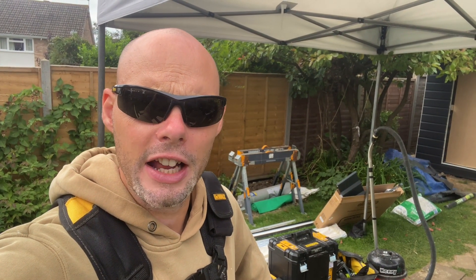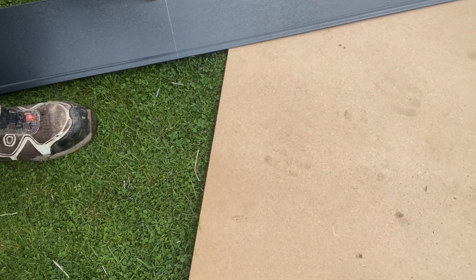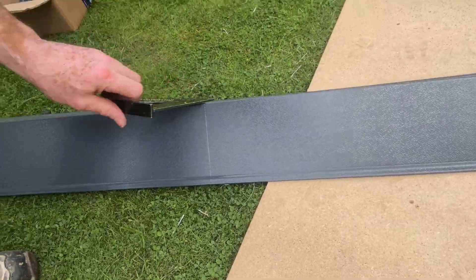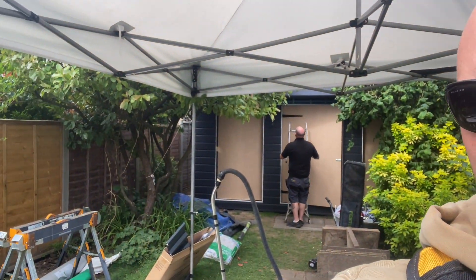That is now the metal sheets on all three sides, all done and dusted. Now I'm down to these bad boys — how do you cut these ones? Because obviously you can't use the plunge saw, it won't quite do the job. Basically a nine-inch disc cutter on a metal blade. Literally — you can see it — marked off there, so just 207 centimetres I think it was. Then I grab my square, plunk it on, mark down — job's a good'un. And now I simply use that just to cut through that bit, and that is it. I'll get these bad boys fitted and then that is it — all closed up. Which makes me very happy. Andy's happy too — he's presently putting in the spots at the front. He didn't like the position of the joists and stuff — I don't know who put those in his way. But that's what happens with a sparky, he's going to be quite sensitive. He's a good lad, though.